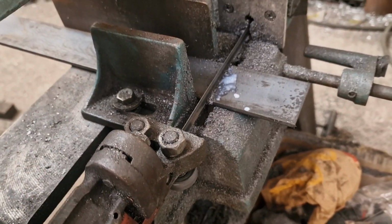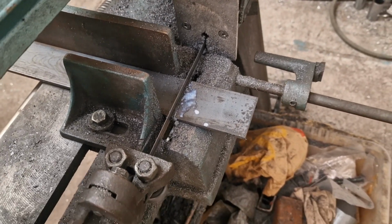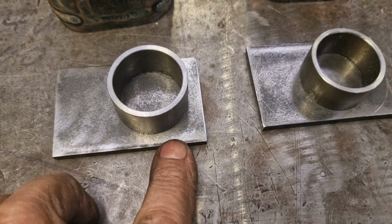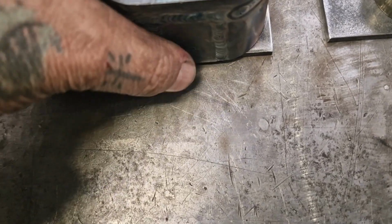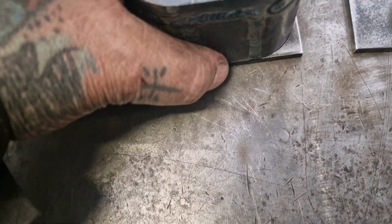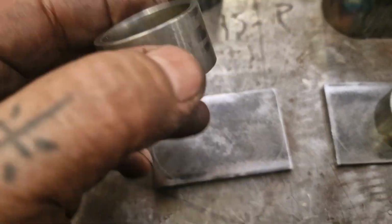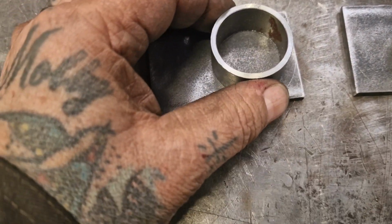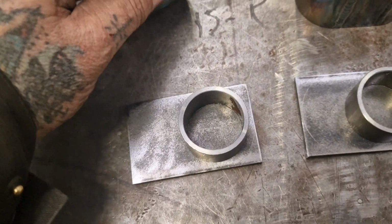And now we get some of this 5mm by 50mm plate. And we cut a couple of pieces off ready to make the caps, the end covers like 3 inches long. So now we've got these bits, these are going to be the covers, and we've placed the corresponding unit on there and scribed a line round the end, and we've cut 2 bits of this, 20mm long, backbone this is, 1.5 inches, and that's going to sit inside to receive the grub screws that are going to go in.